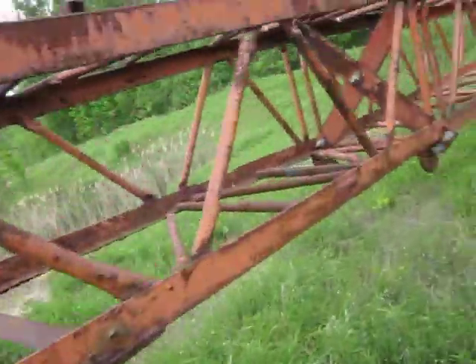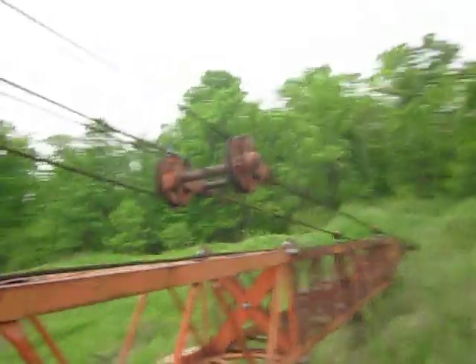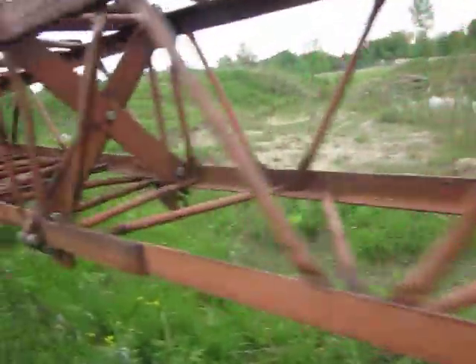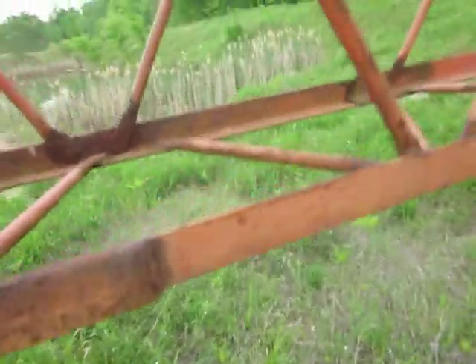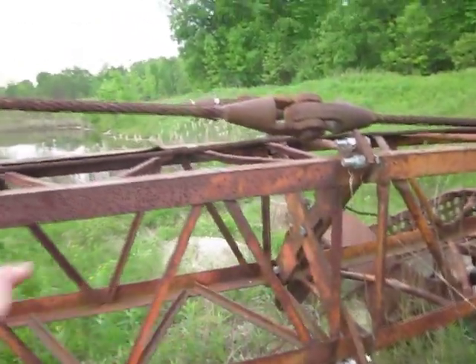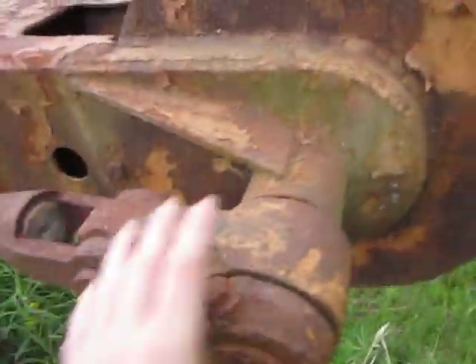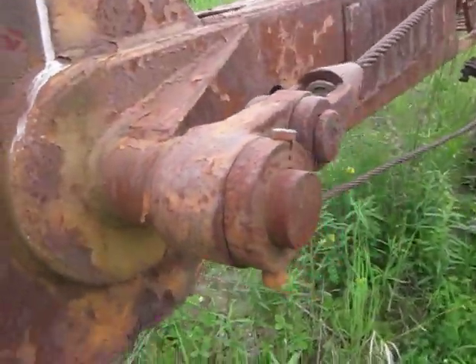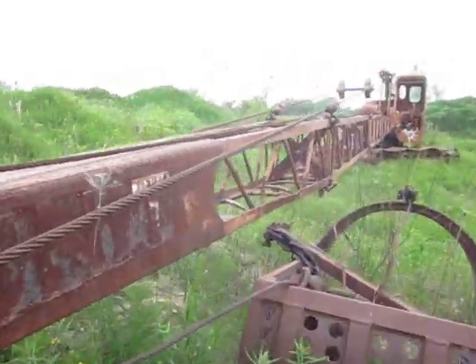Here's your fairlead drag cable that comes out, and here's where your boom support guides would connect way up there. Here's your boom bridle right here, which is in charge of running the parts in the line to raise and lower the boom. At one point — if you see these eye lugs right here — this machine used to have a folding boom, but the owner put in an extra two sections. Here's where that other eye section would connect; they would stick into each other and when you transport this machine you could literally fold the boom inward. That's something cool they added so they could get farther out with the bucket. Here's the end of your drag line boom and here's where it says 'Unit.' Two sheaves out in front — the boom's got quite a wiggle in it.